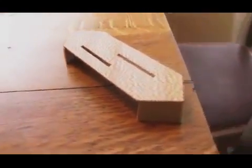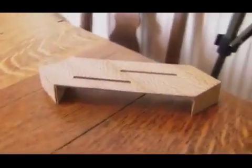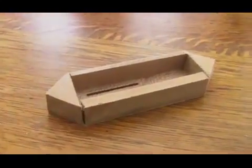Now use some wood glue to stick the supports to the hardwood. Using a clamp is recommended to lightly hold the pieces in place whilst it dries. Next, cut two lengths of MDF to fill the sides in and glue them in place.